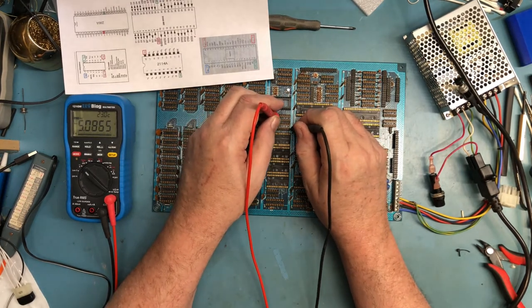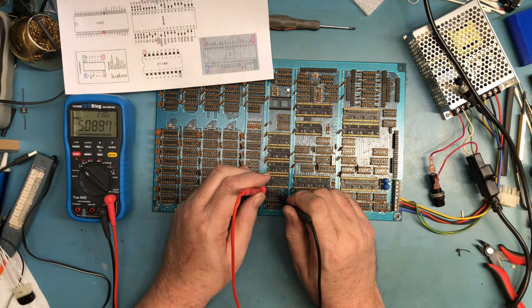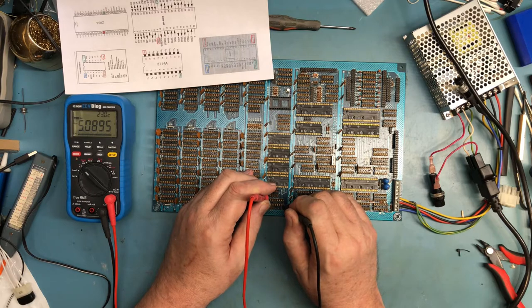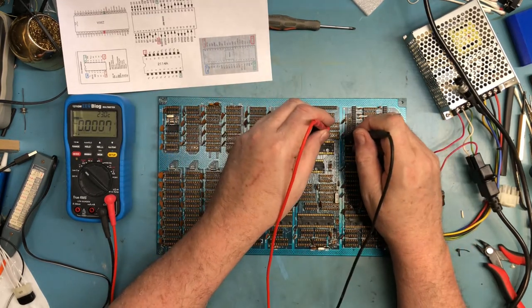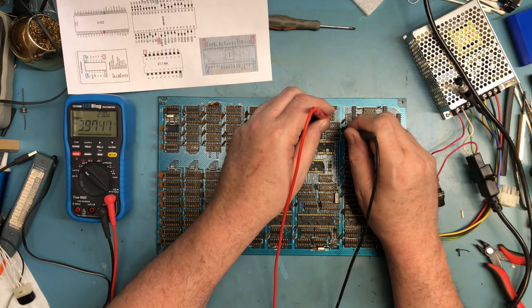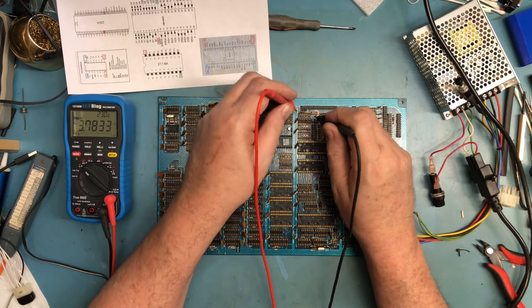You know, if it's a CP/M 2.2 compiled for 64K, and that's the upper bank, we'd probably have issues. If it's compiled for 48K, it might run with that bank being bad. I've probably already checked these, but I should have been more systematic about this.